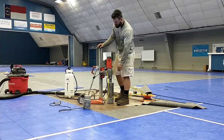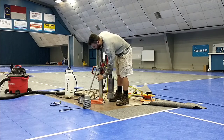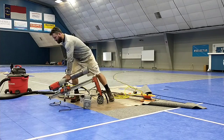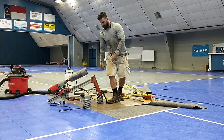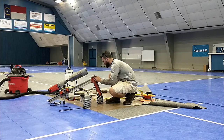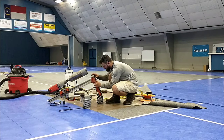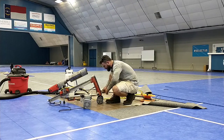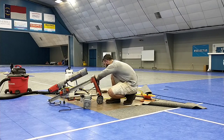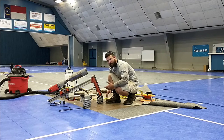So, this is the core drill. I've just finished the other one and I've got to get it set up for this one. It's got this O-ring — it's really more foam than rubber — but it's what seals it to the ground. You've got to make sure it's in here and good. I go ahead and wipe around it and make sure there's no debris, because any little rock or dust will make it not seal very well.